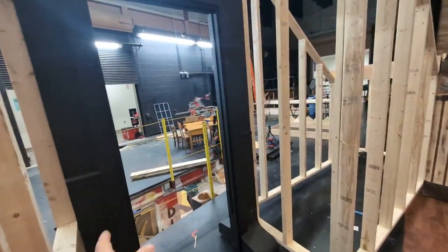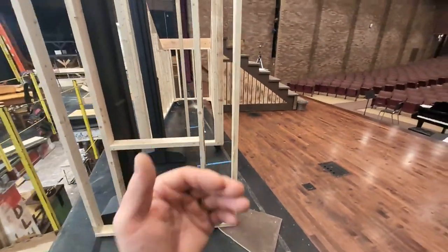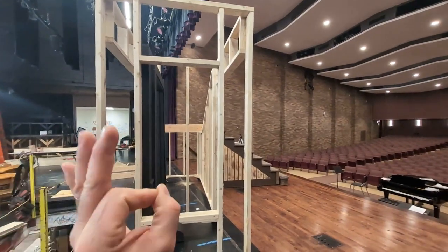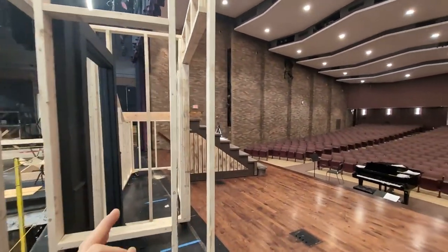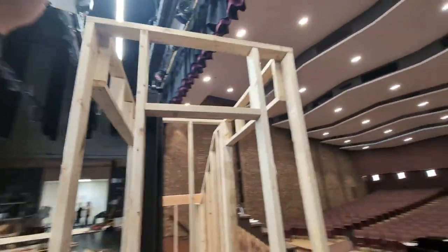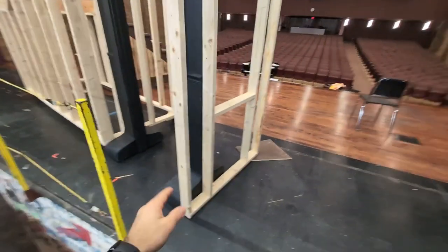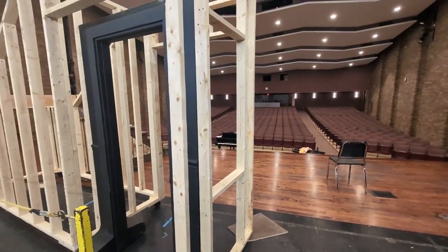And so if I'm going to let go of this rolling door, and I want to operate on this corner to put a wheel in here, and the thing isn't thick enough to begin with, the only thing that kills me is that I hadn't had this in the design when I did the lumber order, and so I ended up wanting these 2x4s to frame this out, but this is like 101 inches tall overall, so the 98-inch long stick to do a stud wouldn't come out of a 96-inch long 2x4, an 8-footer.